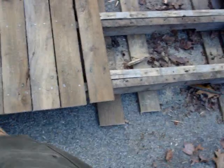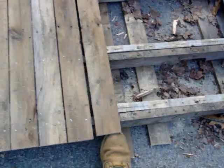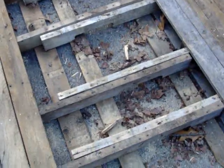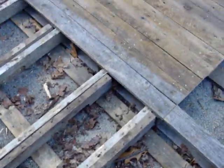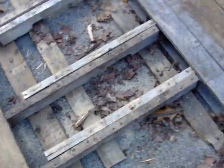They're not nailed right now because this is going to be lifted in sections. So all I did was I floored this up until the point sort of here, and the stringers are going to meet it. I'll carry it back in two sections, lay it out on our foundation, nail it together, and then finish flooring the rest of the whole floor.